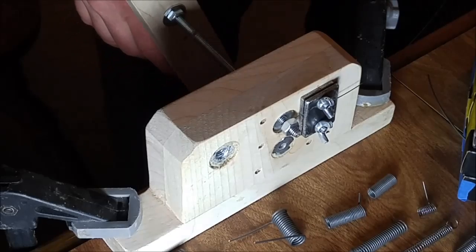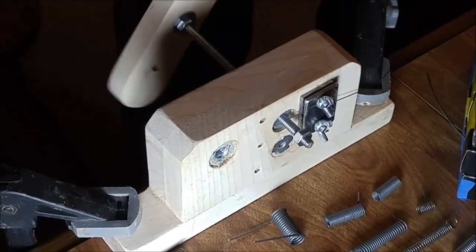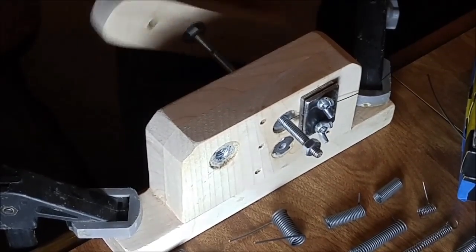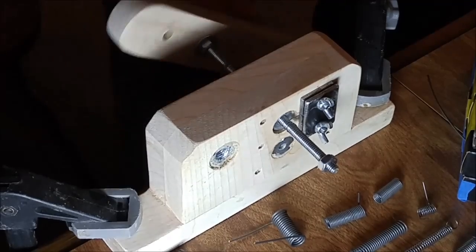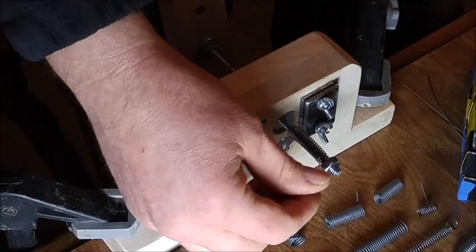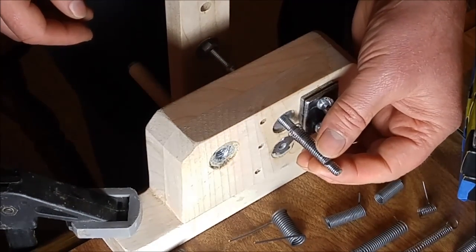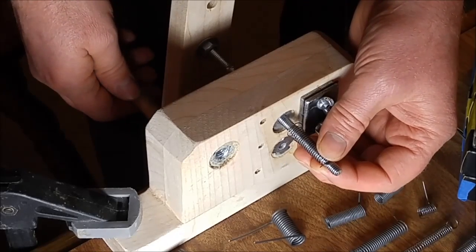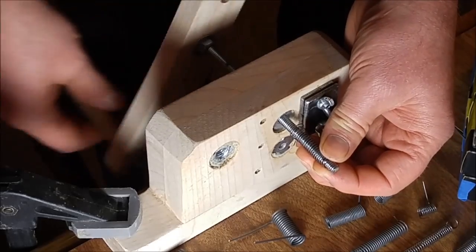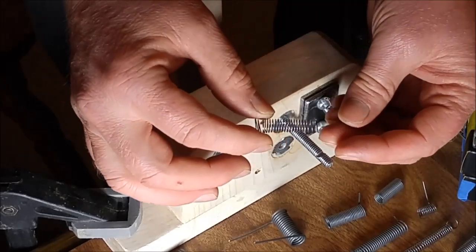You don't need to hold on to the wire — just crank the handle clockwise until all the wire is fed through. Then undo the nut off the bolt, grab the spring towards the beginning of the spring but watch out for the very end, hold that, and then turn the crank handle counterclockwise until you can slide the spring off the bolt with minimal force — just like that. And that's the spring right there.